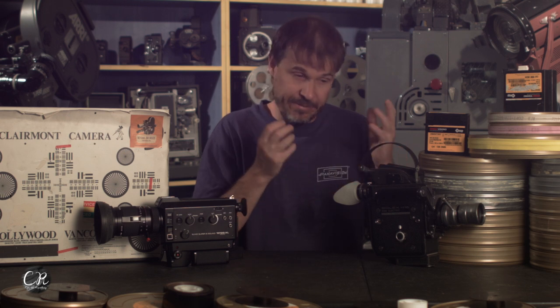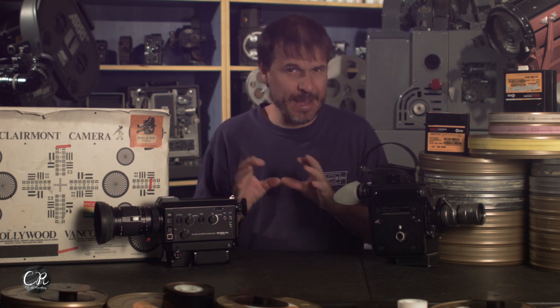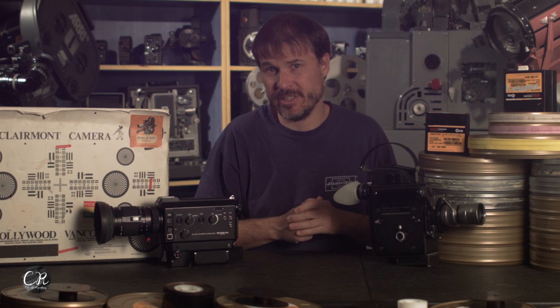When you hear the motor running at that speed, that's the speed it should work at. But when we turned on sync sound at 24 frames a second, 60 hertz, it wasn't working. So I think we got a dud on that sync sound crystal oscillator, which is unfortunate. Before I throw it away, we're going to try a couple of different cables. But I don't think it's worth experimenting too much because it works the way it is — which is quite amazing for a camera made in the 80s that doesn't have a crystal lock.